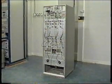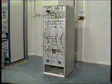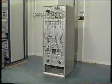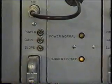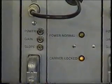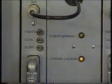We have seen how the transposer gain is controlled with the pin diode attenuator in the IF amplifier. This subsection explains in more detail how the AGC system works and how the output power is set. It concludes with a demonstration of setting the power and gain controls. Whilst the gain control device is part of the IF amplifier, the remainder of the AGC circuits are mounted in the same module as the UHF amplifier.